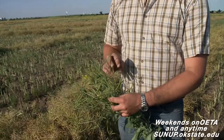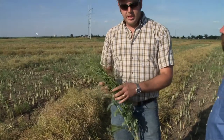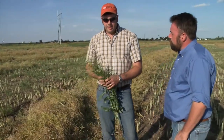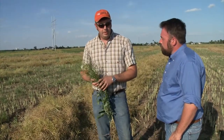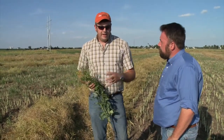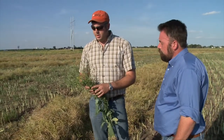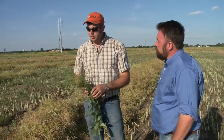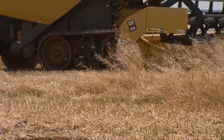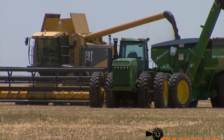Sometimes we have an issue where we have a lot of biomass and not a lot of pods. In some areas of the state we didn't get very good pod set, so we got a lot of biomass and not a lot of seed, and sometimes that causes issues trying to get separated on the shoe — get those sieves set correctly, get your air-to-air ratio set so you're getting enough to separate the material but not blowing the canola seed out the back. Typically we're allowed quite a bit of dockage with canola. It's not a true discount, but they just subtract the dockage material weight from your canola weight. So leaving your sample a little bit trashy if you have the luxury of keeping it below that ten percent moisture. But if we have a lot of green material and green regrowth, we're going to have to try to clean that seed with the combine pretty heavily to get it under that ten percent moisture.